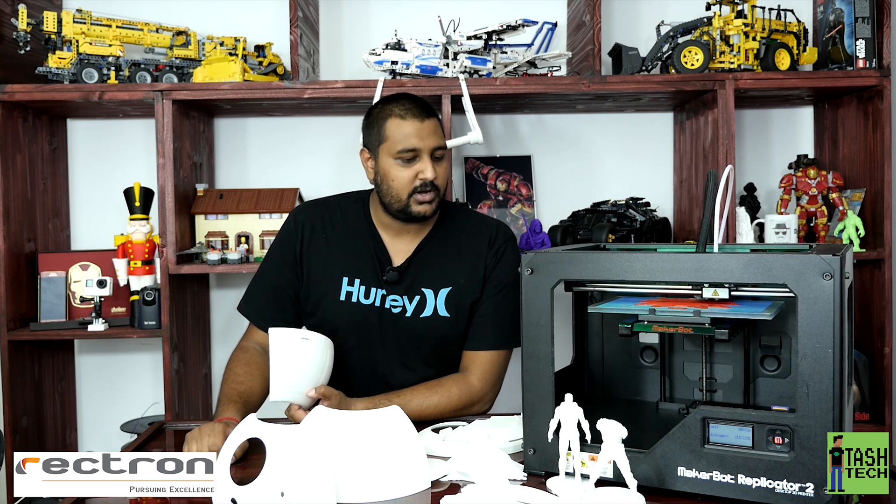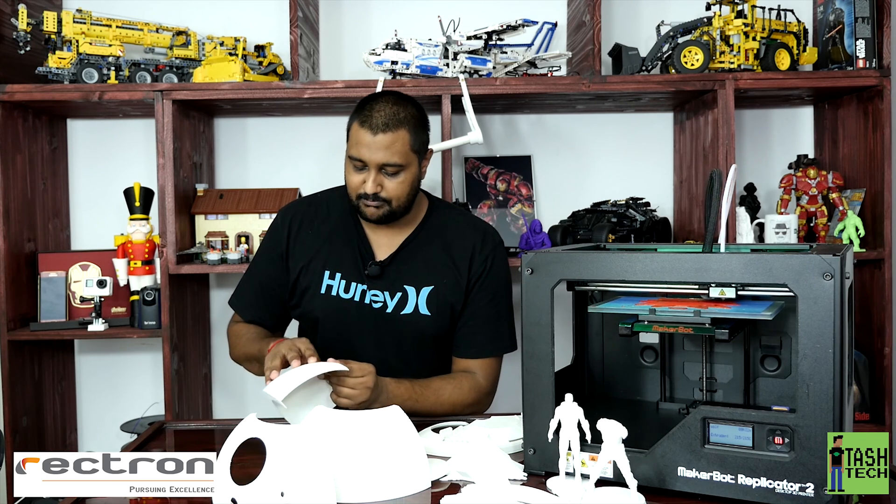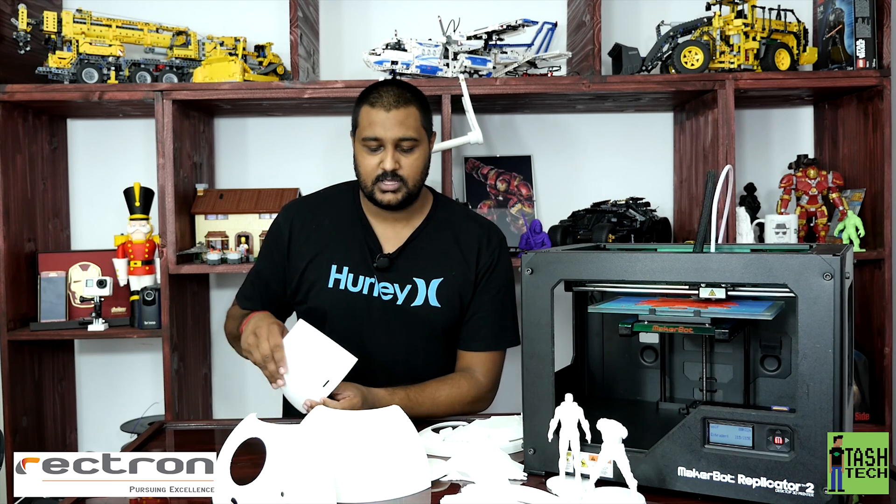The main thing I had to change was my filament size — it's 1.75 — and I noticed on the 5th generation it was automatically set to 1.77 when I downloaded the software. That's the default setting of the filament size. I thought 1.75 is the filament size, I'll save it as 1.75. I printed a part and we had a lot of little bubbles and things on it. I then changed it to 1.77 and it was perfect.